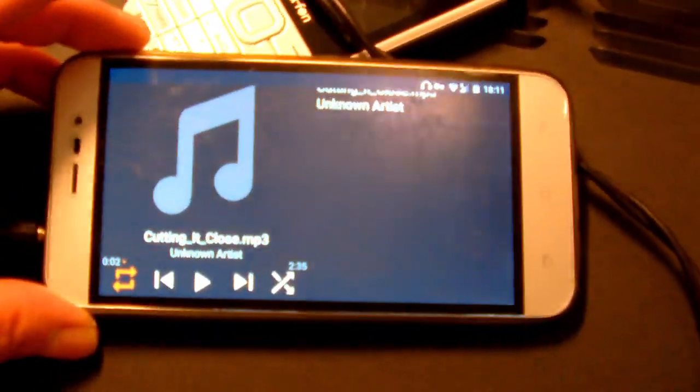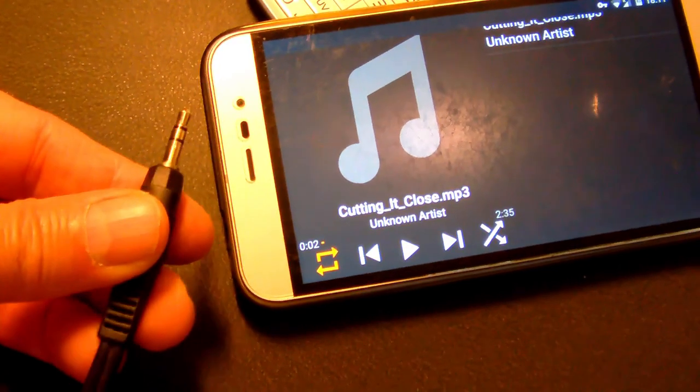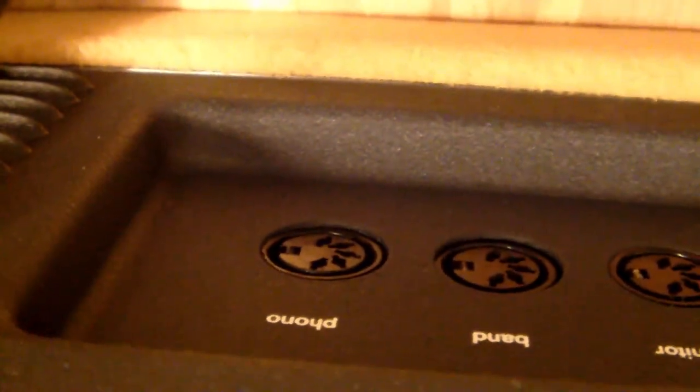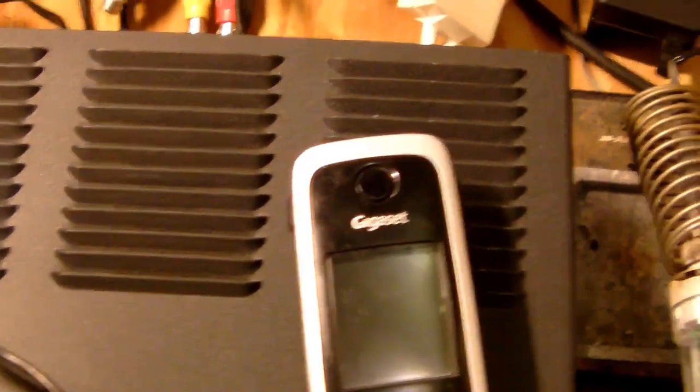Alright, I connected my smartphone via a stereo 3.5 mm connector, you see here, an earphone jack really, via some Cinch connectors to a DIN 5-pin adapter. Okay, and I'm going to connect that to the appropriate connector on the back side, and I'm going to choose the phono input. You see there, and there you go. Yeah, unfortunately, European equipment often uses DIN connectors instead of jacks, which is more standard in American devices.